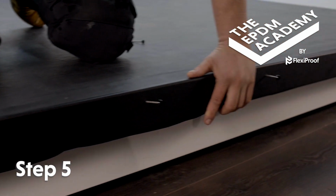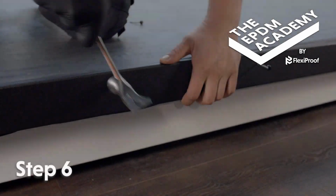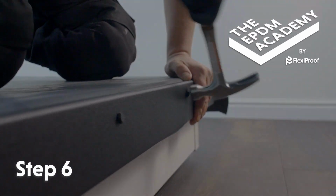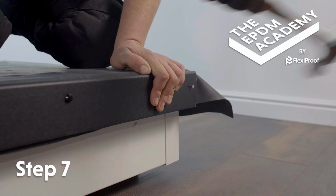Position the gutter trim front plate onto the membrane-covered backplate. Hammer a PolyTop nail into each of the pre-drilled holes. Hammer a fixing pin into the gutter trim at the corner.